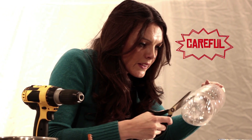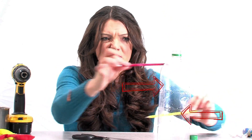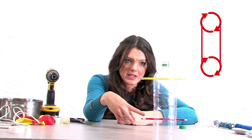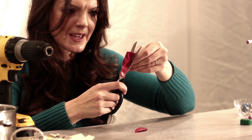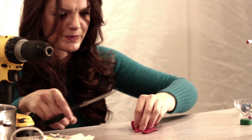So let's make our homemade Van de Graaff Generator. The first thing we need to do is get our 2-litre plastic pop bottle - this is going to be the housing. Take the scissors and cut around the base to open it up. Take your 2 pencils - these are made of wood, which is quite important, I'll come to that in a bit. We just want to put our pencils through the plastic bottle; they are going to act as our pulleys. Between the 2 pulleys we need a belt, so if I just slice a bit out in the middle of this balloon it will make a nice round bit of rubbery material.